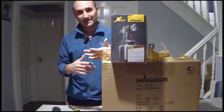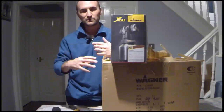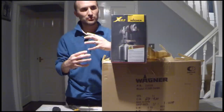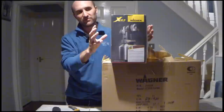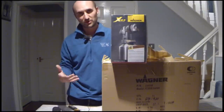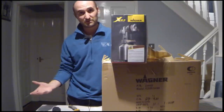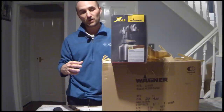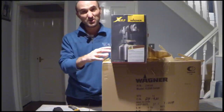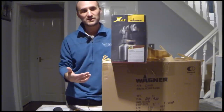I'm quite used to using an airless sprayer, as some of you may have seen in previous videos. This sits more along the lines between an airless sprayer and an HVLP — it kind of meets the two, so you can do both. With the fine end you can use it for more detailed work: things like spindles, doors, skirting boards, architraves — which is kind of what we're going to be using it more for, because we've already got the big airless sprayer, the 250, for all the walls and sealants. We'll also use it on some walls and ceilings — maybe if it's just the inside of a cupboard or a small bathroom ceiling.